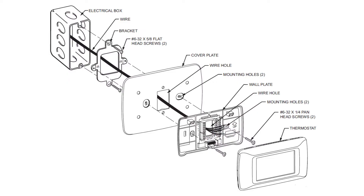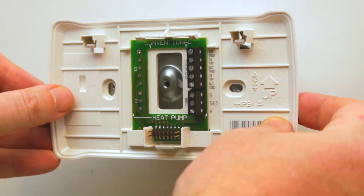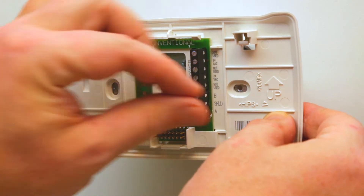With the optional cover plate assembly, it can also be mounted vertically on a standard 2x4 inch electrical box. The mounting procedures vary depending on the mounting location and the instructions can be found in the NOVAR XEM LCD installation manual. In this tutorial, I will be mounting to a 2x4 inch electrical box, which simply requires two standard 6-32 thread screws.